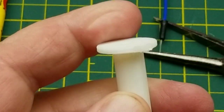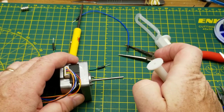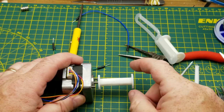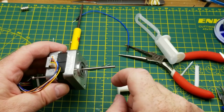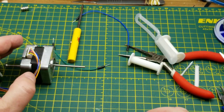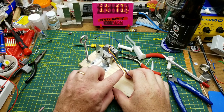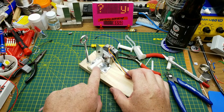I sized the hole to just over three millimeters because the shaft is three millimeters — it slides on there pretty well. Just for experimenting I'll glue it on. I'll quickly mount one of these in the same brackets I was using last time and see what happens. The other problem was keeping the line going straight onto the spool.